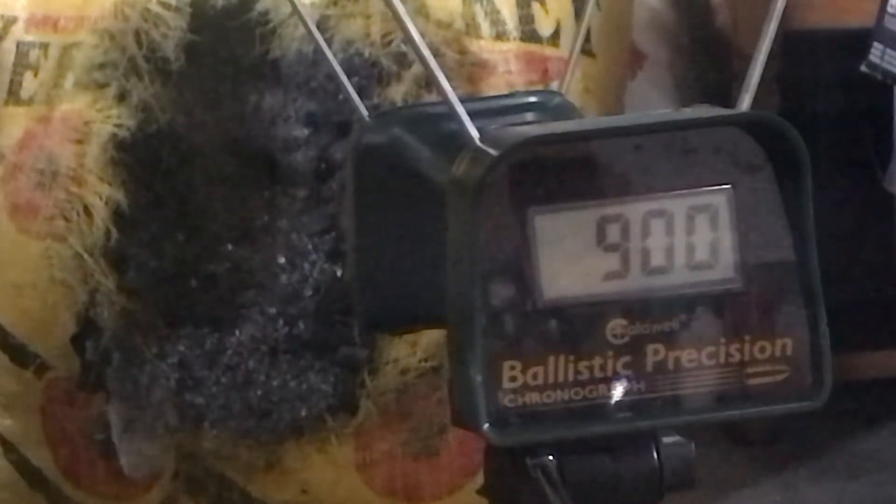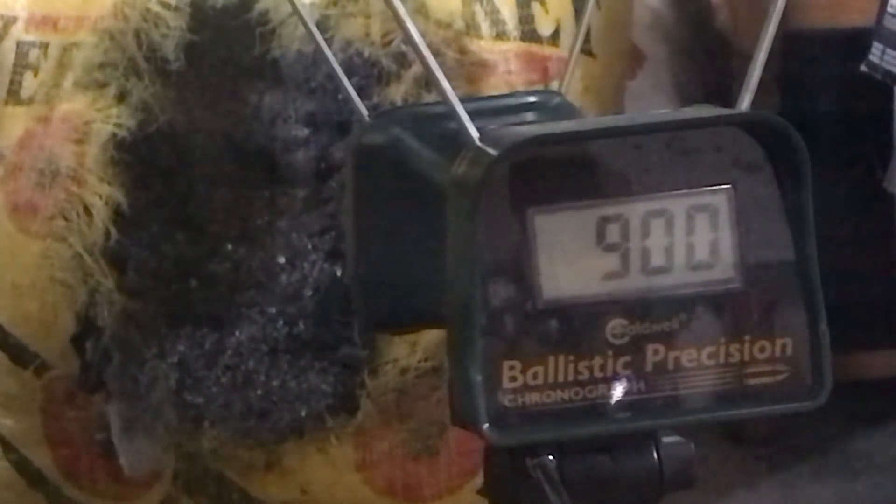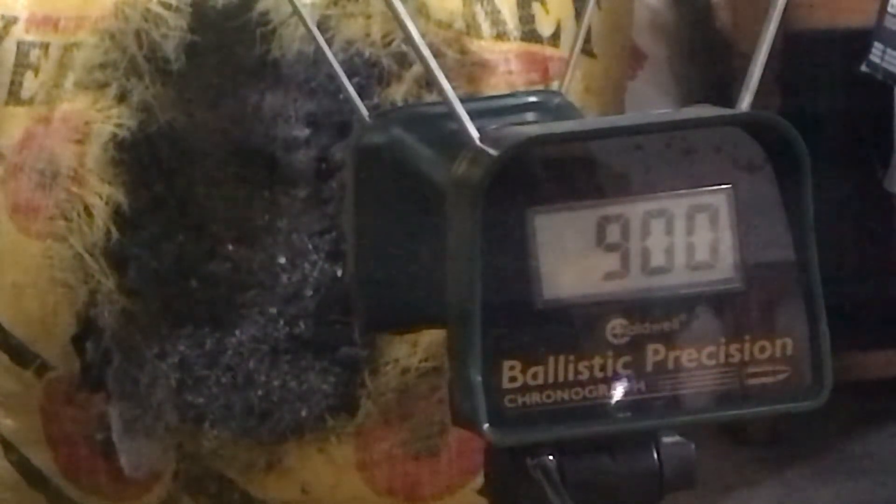So we are going to go back and shroud the barrel and tension fit it. That means there's going to be a shroud that fits over the barrel, tensioned on the muzzle end, because we did actually thread the barrel of the rifle where we have the muzzle brake. Our new cap on the end will actually tighten up and put a tension on the barrel, helping with harmonics and hopefully accuracy with this rifle.